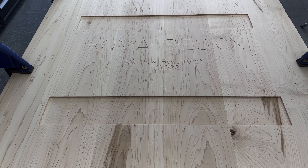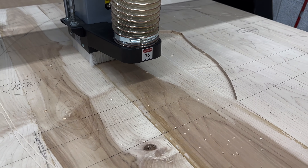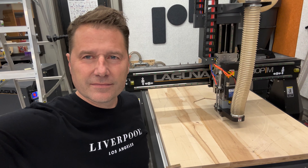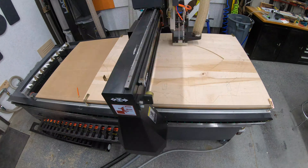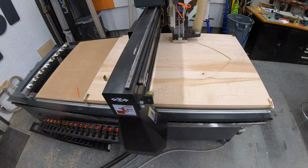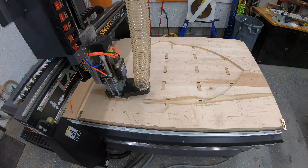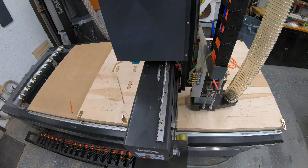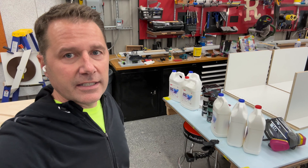Here we are with the big boy — the real thing. Just laying out six-quarter maple boards, an inch and a half after planing. There's the design I drew up in SketchUp, which translated into vector for the CNC. We dominoed this together and edge-glued the boards. The dominoes help with alignment but you have to make sure you miss them when you cut out the profile. I etched out the back so it would sit closer to the wall, and here we are just starting to run the program to etch out the pocket where the epoxy will be poured.